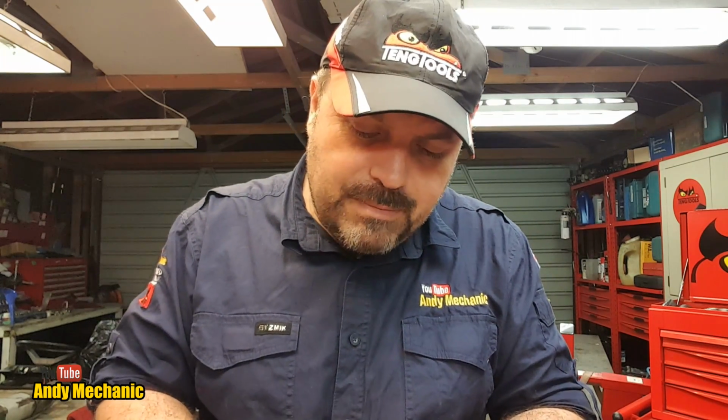As I've already explained, these batteries are extremely dangerous, so I'm quite tentative when it comes to charging them up. I'm using my adjustable power supply to do the charging. It's possibly wrong, possibly right, I don't know. But I'm going to be using about 4.5 volts as the charging voltage, and I'm going to measure the current flow.